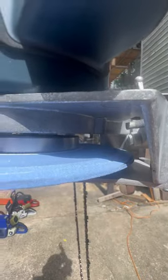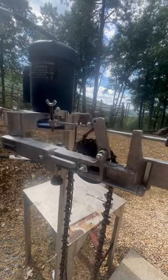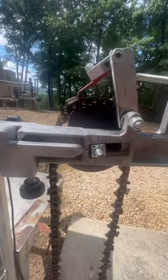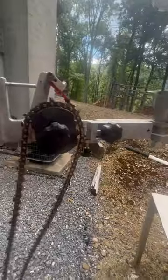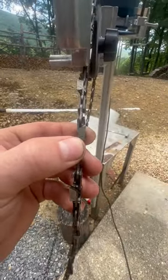Right here — I ordered a second one, $39 from Madsen's, so it doesn't wreck my wheels. This is the chain I'm doing — 404. This is kind of how I have it set up; it's really set up for a new chain. I like this grind, it cuts pretty fast. I'll show you the top plate angle — it's pretty flat.